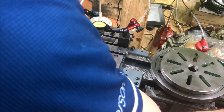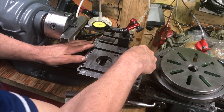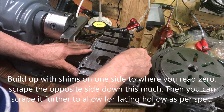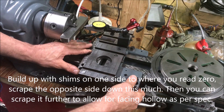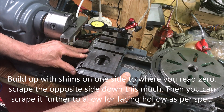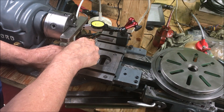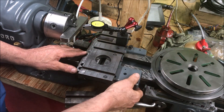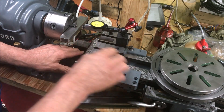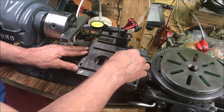Different means doing the same test. I do a dry test like this, then shim up here, measure how much deviation - the thickness of the shim I will have to use - and then scrape. So if I want to correct it, I'll have to shim up on this side and then take off. Let's say I shim up with two hundredths of a millimeter and then scrape off two hundredths here afterwards. Then when I run it flat, I know how much to scrape there.